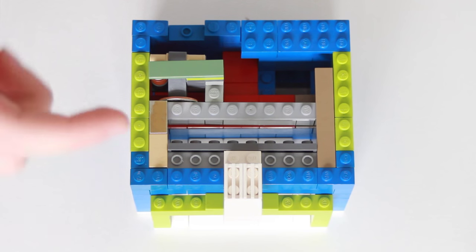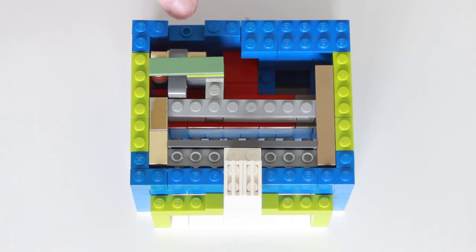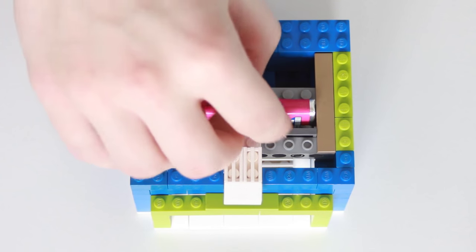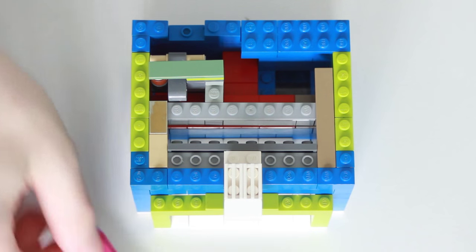Now what happened is that when we put in the dime, it fell through a series of ramps, falling right here, which is a very important spot for the coin to be, but I'd like to remove it first. And I also removed a piece that was right here so I can show what happens with the machine when it's free. So if this was free, it would just be a dispenser, meaning you push it back and then a Pez can fall in because this has been moved to an appropriate spot. And then when you pull it forward, it's dispensed to the customer.